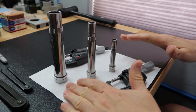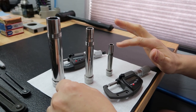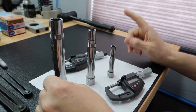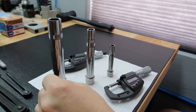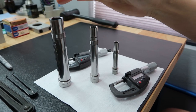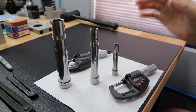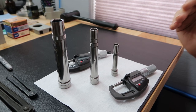Okay, we're back, and I'm actually in Lance's spot because I want to show you something. When we were just measuring this little accessory spindle, I was doing it on the platform, and we measured 12 millimeter but under 1 micron. I was really expecting under 2 micron, because that's the reading we get when we measure any good Levin spindle, from this large one. I've got a few up here: the 3C, the D, and the little accessory spindle. They should all read the base measurement and then 2 microns under. I just want to demonstrate that to you.